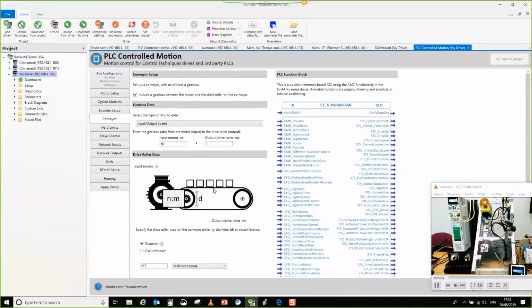You should probably almost think about how they did it in MCS with the PLC Open on there. They did a nice job with it. They actually have a tab called Dual Loop on there where you can set that up. Sure. In this case, the dual loop part of it is hidden from you in the background. As long as you understand what your ratio is, the tool goes and sets all of the rest of it up for you. So you don't need to know how to configure this and set 326 and all of those other pieces. It does it for you.